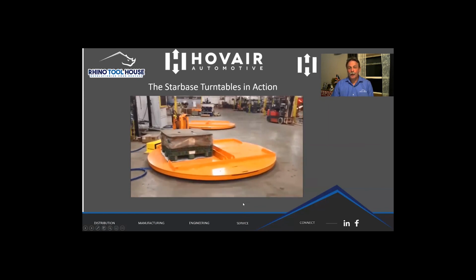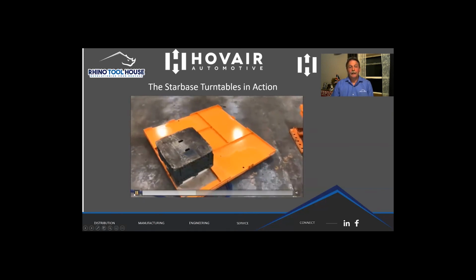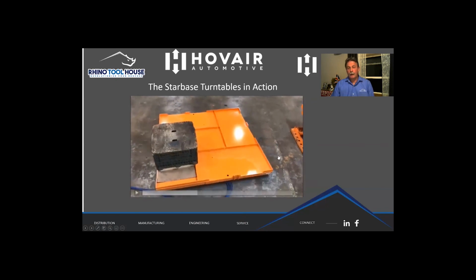As you can see, this is a round turntable, so it would be encased in a platform. So this is a 2-position turntable. So here we see a 4-position turntable, and now we actually call this a side by end, which has got 4 racks go on here, and the operator will be working out of this one, and then the empty one will go to here, and it will go to here, and it will be changed, and the fork truck driver can either change 2 at a time or 1 at a time. And the reason for a 4-position turntable as against a 2-position turntable is the fork truck driver only comes around half as often, which makes his time more efficient.